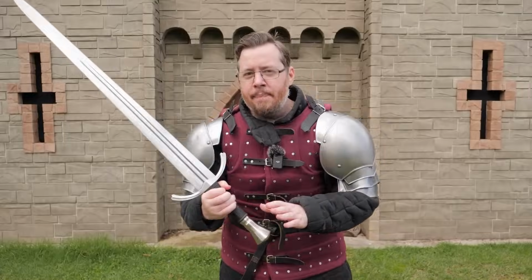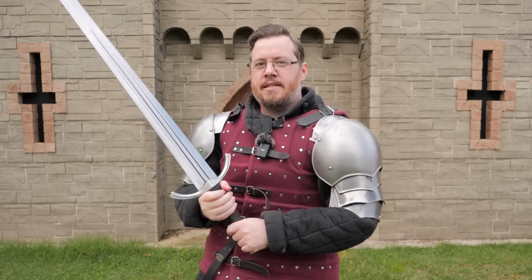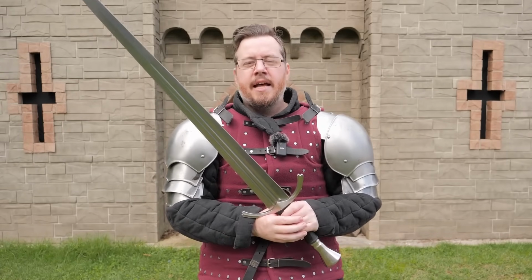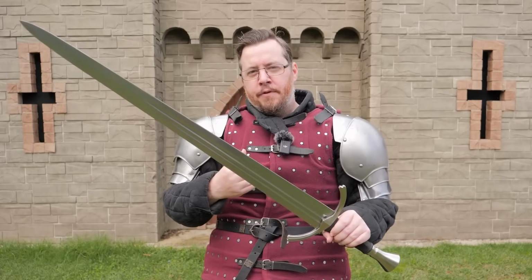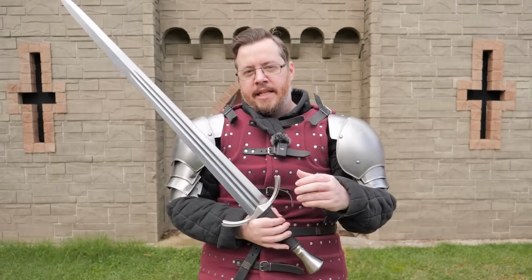And remember, this is happening as those crystals are forming as the metal cools, creating this crystalline grain structure. If you can speed up this cooling process, you can rob the ferrite of enough time to force out the carbon into these more dense pockets of cementite structures. Because the thing is, when the metal is heated up to a certain phase and it doesn't have these crystal structures, the carbon is actually diffused more evenly because the atoms seem to have a bit more malleability and it's easier for the carbon to be diffused. It's only when the crystals start to form does it want to force out the carbon in its locations and we get these structures forming.